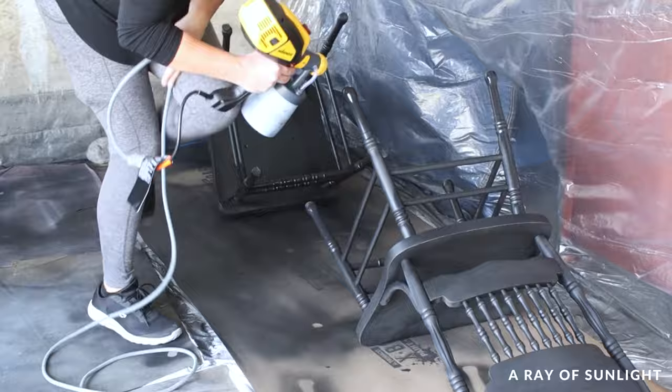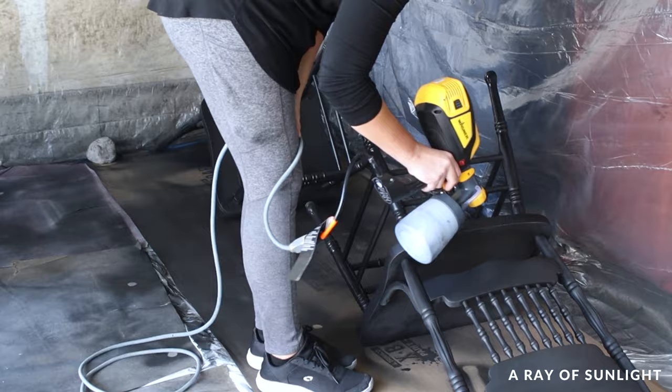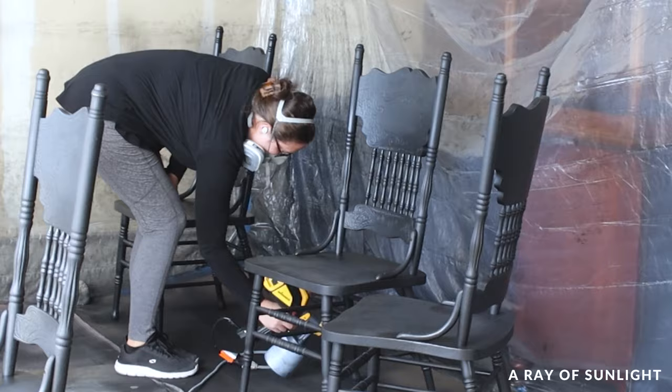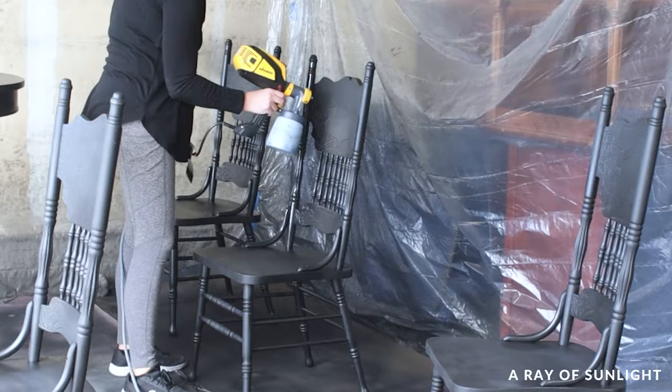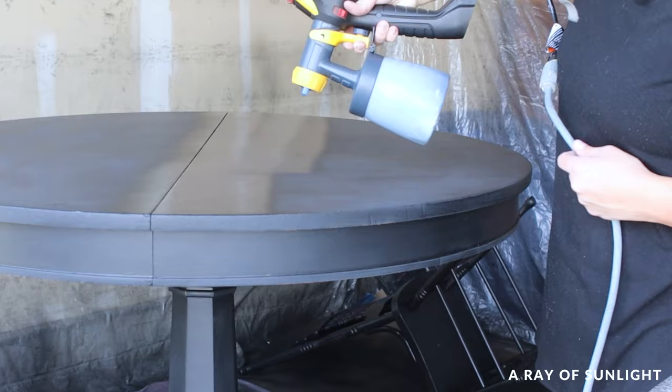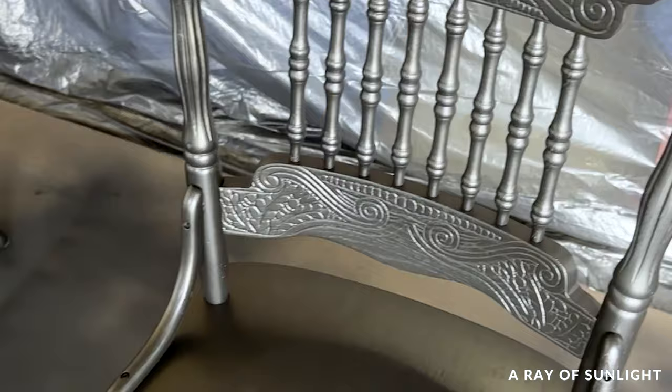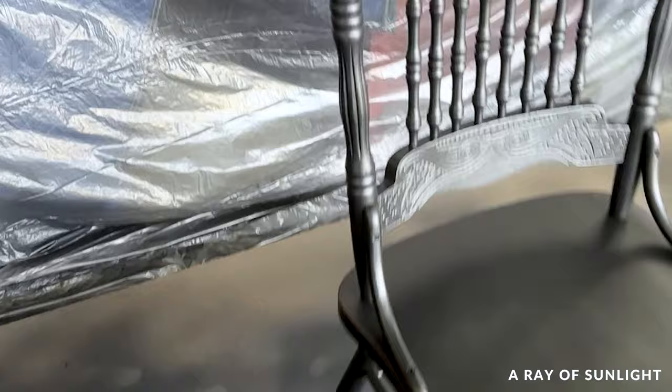This paint is self-leveling, so it's great for brushing or rolling and you won't get much texture or brush marks left in the finish. But painting all of these spindles will take a very long time if you're doing it by hand. With this paint you need to let it dry for about four hours between coats. I managed to get one full coat with most coverage, then sprayed a touch-up coat on the top of the table and chairs where I needed a bit more paint. After everything dried it looked so good. And this paint doesn't need a top coat — actually, you should not use a top coat with it. Just let it dry for at least 24 hours before using it carefully, and be extra careful for about 30 days until the paint is completely cured.